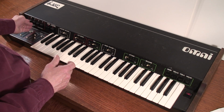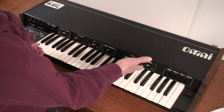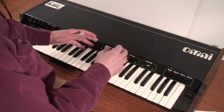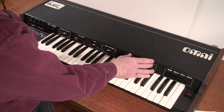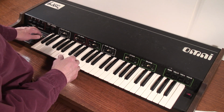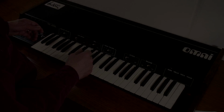One other thing to note is that there's an interaction between the ADSR of the synth and the attack release envelope of the strings. The string section goes through the signal chain first, and the synthesizer section follows. So the attack release envelope has priority over the ADSR envelope. I'll show a diagram because it's easier to show it graphically.